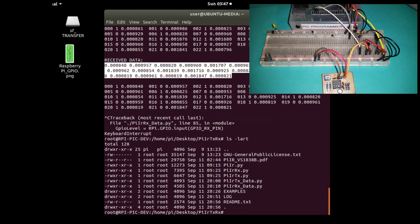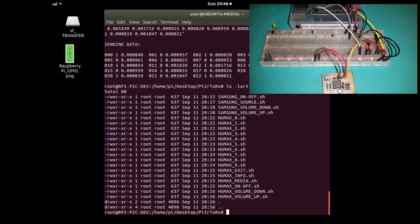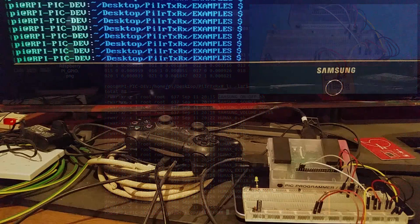If I come out of this, I've copied that data and I enter the transmit script — it just takes one argument which is the recorded data, and hitting enter plays the data back. I'll go over to the TV and use what's in the examples directory, where I've recorded a load of things for my television and my Humax satellite receiver, and I'll change the volume level, change the source, and turn the TV on and off.